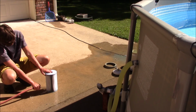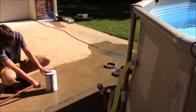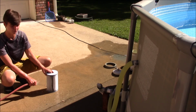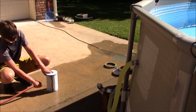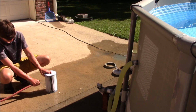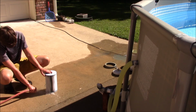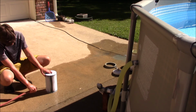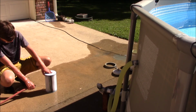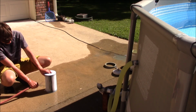It's pretty good. Anyhow, this filter is extremely dirty. Extremely dirty. It's been running for about a week on a 12-hour chlorination cycle. 12 hours, well, because why not? It's only keeping my chlorine level at 1 part per million, which is really pathetic. I need to clean the salt cell. I don't think it's outputting near what it should.